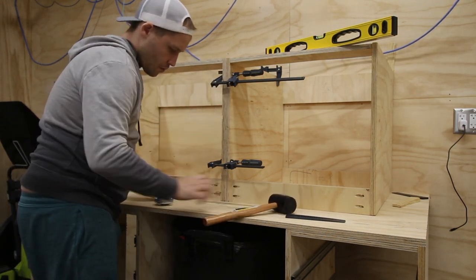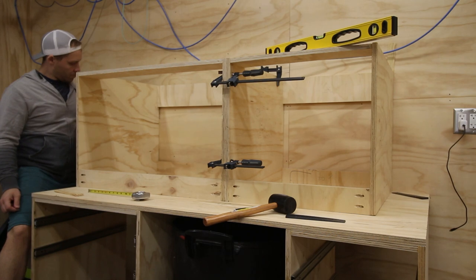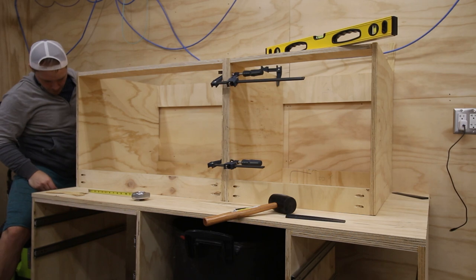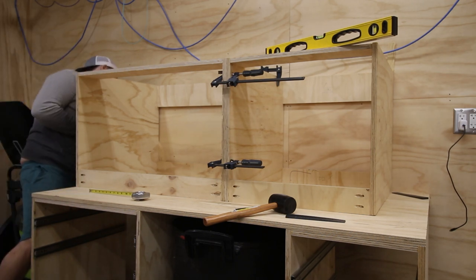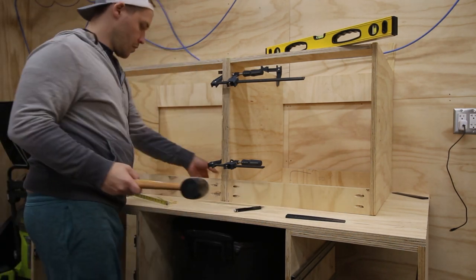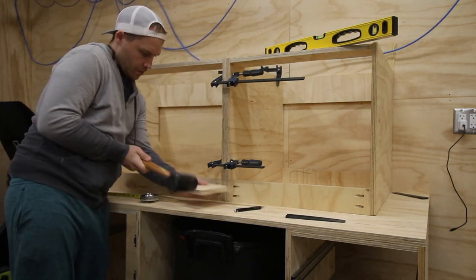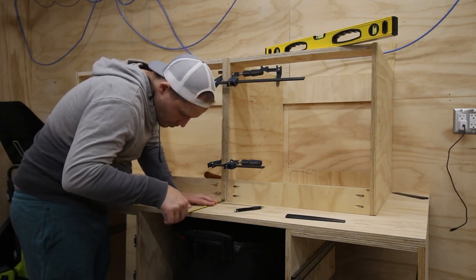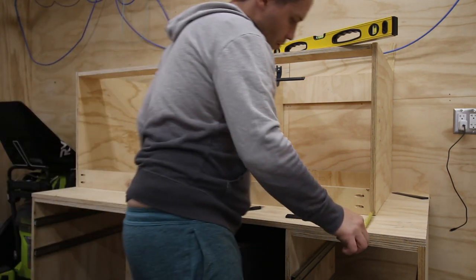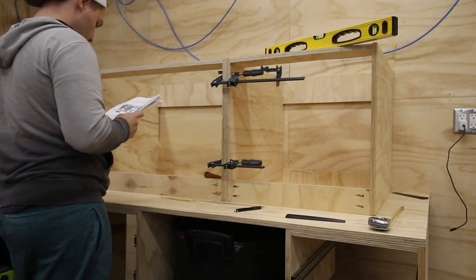I decided that the most important parts to be level and accurate were the front face of the uppers in relation to the front of the lowers — making sure that each of the cabinets was flush with one another and that the combined front wasn't more than 14 inches away from the front of the lower cabinets along its entire length. This created a gap or two where the uppers were supposed to be attached to the wall, so I simply used some carpenter shims to fill the gap before securing it to the wall. I also needed to use a few shims along the bottom in the back to make sure that the cabinets didn't rock when an uneven load was placed on top.